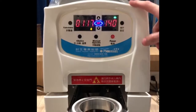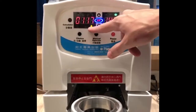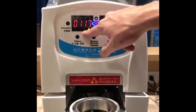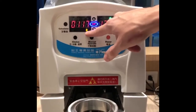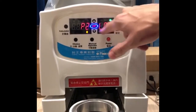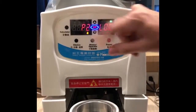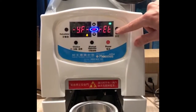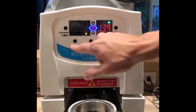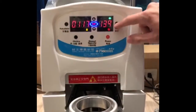Now we're going to talk about P2. This will count how many cups or containers you're sealing up to this moment. So far we have been sealing 117 cups. If P2 is locked, that means you cannot modify it — it can be hidden or shown, but it will still read 117.